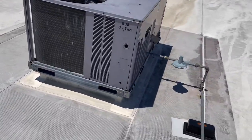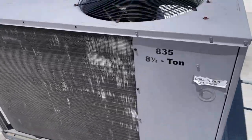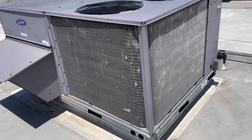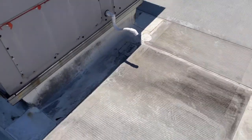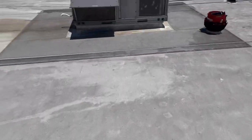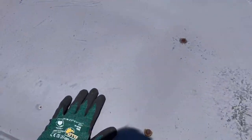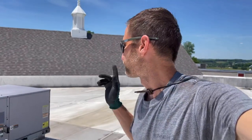This one's not running. I saw only two thermostats downstairs. This one is running — space was 72 degrees Fahrenheit. It's a Carrier WeatherMaker, good unit. No water coming out of the condensate drain, but it is dry out. I feel heat coming out of our condenser — that's a good thing. This other one's not in cooling — I don't even feel the blower running. This may be the one with that breaker turned off. That's probably why they shut it off and taped it off. I wish they would have left a note who did it and why — locking out, tagging out — but they did not.